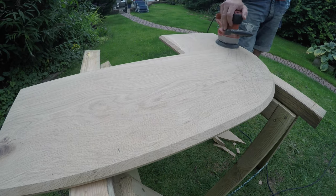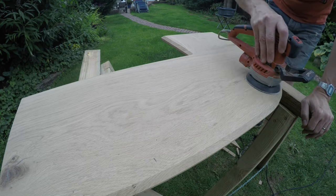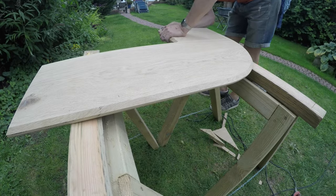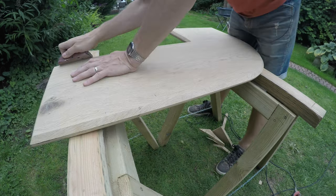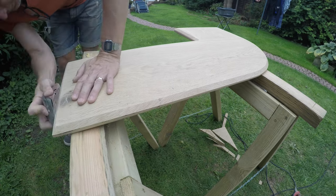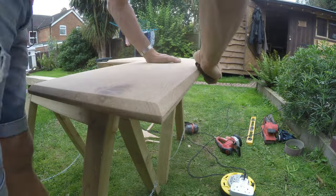Trying to be even-handed about it, going to the edges. As you do the routing, it does give you a quite nice finish, but you do have to take off little ridges and little bits and pieces. Sometimes you get little scorch marks — you can see a little dark patch on the corner, which is a scorch mark. Just watch me removing another one there.